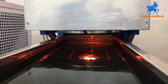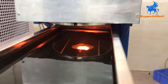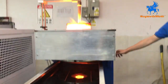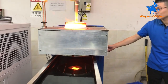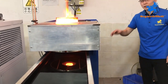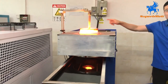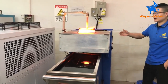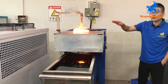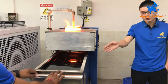It's close to finish — only a little left. Let's check. Lift up and down to check — it's finished. Already done. Let's turn off the power. Important: don't turn off the chiller. Keep the chiller running continuously until the crucible cools down — less than 100 degrees — and then you can turn it off. That's the full process.